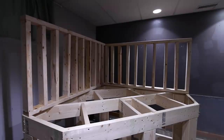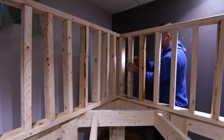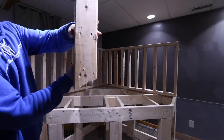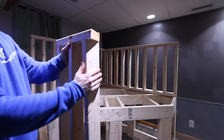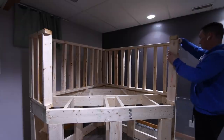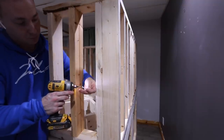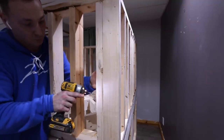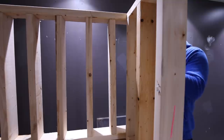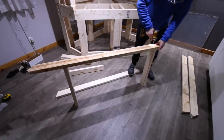Rinse and repeat — a lot of things you have to do over and over again. This isn't difficult, it's just very repetitive and time consuming. I think this took me about six to eight hours. There's the window — I don't want the stand and tank to be so tall that it obstructs the window, because it could potentially be used as an emergency exit. In the back of the two frames I just butt-jointed them, and the front is where it gets more difficult with those 22.5-degree angle cuts. You might think just screws won't hold it, but remember I'm going to be wrapping this in plywood on the inside and out, which adds a massive amount of structural integrity.